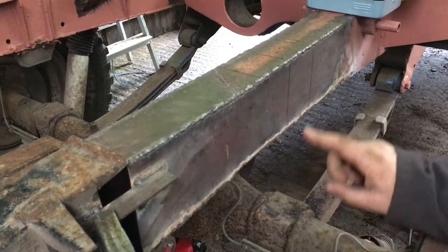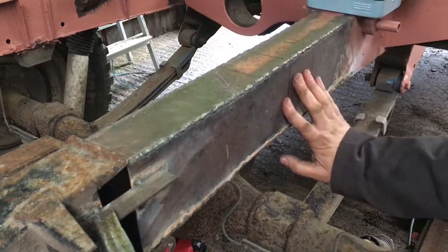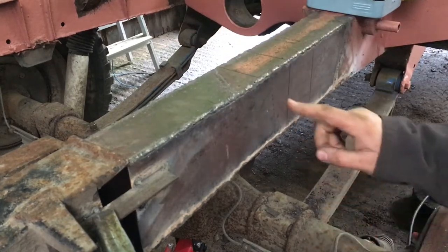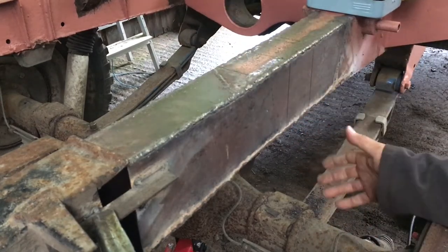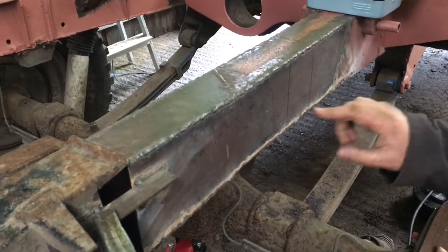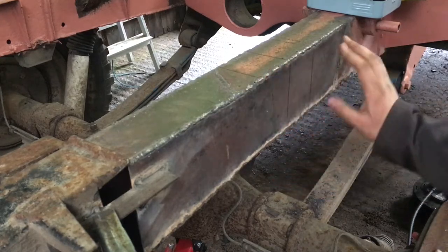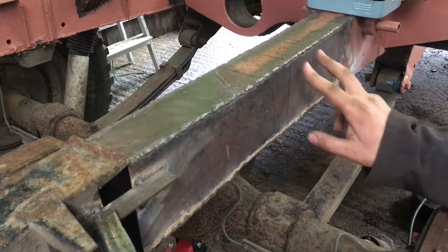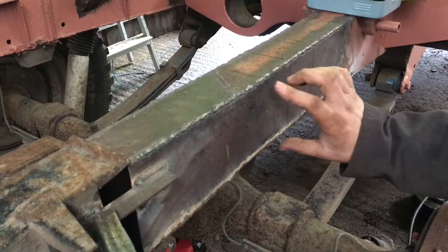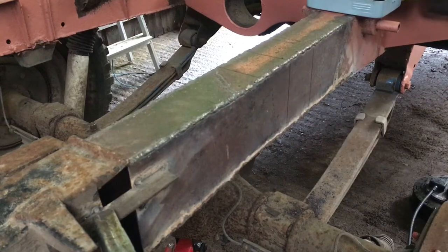So now I need to reinstate all the bracketry and everything on both sides of this and the holes for the axle check straps, which I don't have fitted, but I'm going to put everything back as it was. So I've already dot punched the four positions of the holes using the template that I had before, and I marked where the two stiffeners were and the positions of the holes where the two large brackets go on the outside. So we'll start by drilling these holes